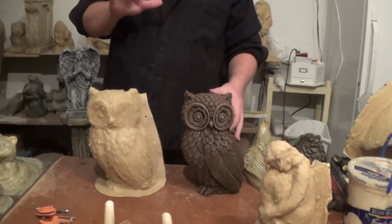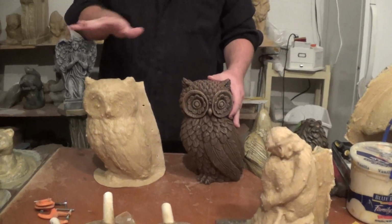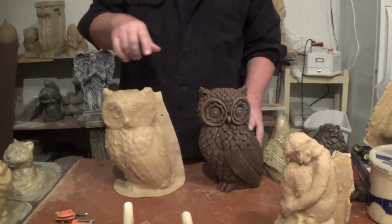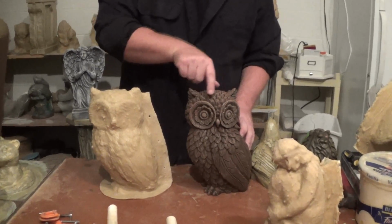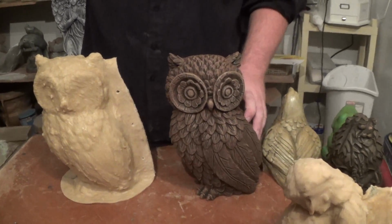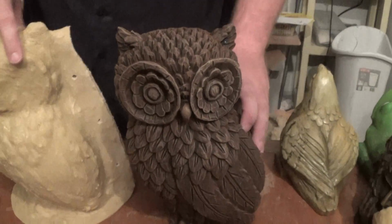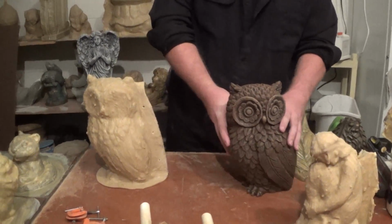I'm also going to be continuing my series of how to do the paint finishes. That seems to be the one that everybody really enjoys, is seeing all the different finishes that you can do on statuary, such as this finish. Now, if you saw my first of my painting videos where I did the black with the white dry brush over it, this was done the same way. I did a black base coat like I did in that video, then I dry brushed over with a brown, and then I took that same brown and added a little bit of white to it, and just very, very lightly went over the brown again with a lighter coat of the brown to give it an even softer look. And it gives it a very nice look. So that there is just another idea for one of the paint finishes. But I'll do more of the videos showing that.